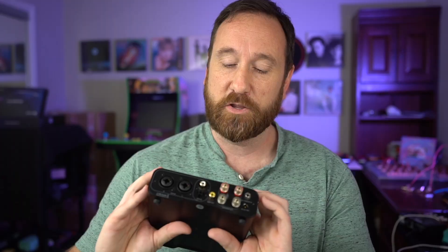The thing about the mono mode with this amplifier is that it does not double the output power of the two channels — so it's not bridged mono, it's just mono. It gives a little bit more power to the single output. Another thing I want to point out is it has a subwoofer output, which is pretty cool — except I'm going to show you why it's not pretty cool in the measurement section of this video.